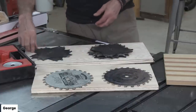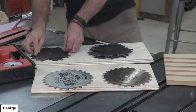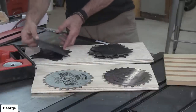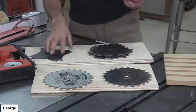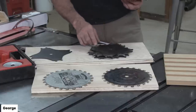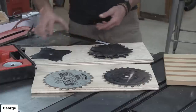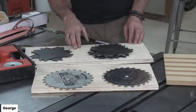Now in this pile, I showed you that's a 1/16 chipper. This is a 3/32 chipper. Today's plywood is commonly somewhere around 23/32 thick. So this is buying advice on dado heads: if all I have is 1/16 and 1/8-inch chippers, I can go usually from 1/4 inch, that's using only the two rim blades, to 13/16, that's the entire stack, 1/16 at a time. If I have a 3/32 chipper, I can build that all up in 1/32 of an inch increments.